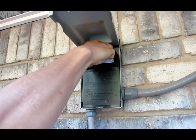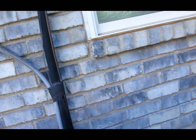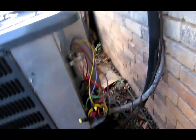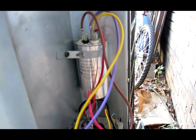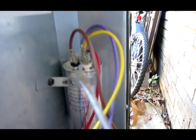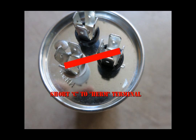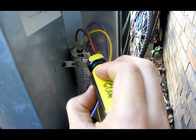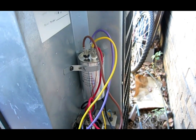Let's first turn off the power at the breaker box — that's off right now. Then let's come down to the run capacitor. Before you touch the run capacitor, it's good to drain it. This is the run capacitor. Short the common to the compressor terminal to make sure it's all drained out. That's all drained out — safe to touch.